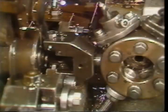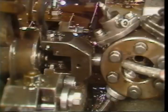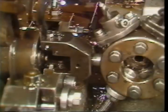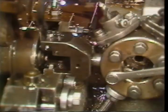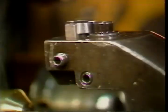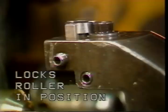You can now adjust for the length of the knurl. You may use the cutoff blade as a reference in helping you to set the correct length of knurl. This knurling tool holder has two set screws. This one will lock the depth screw in position without locking the roll holder. This enables the roll to be turned to achieve the desired knurl pattern on the part without changing the depth of the knurl.